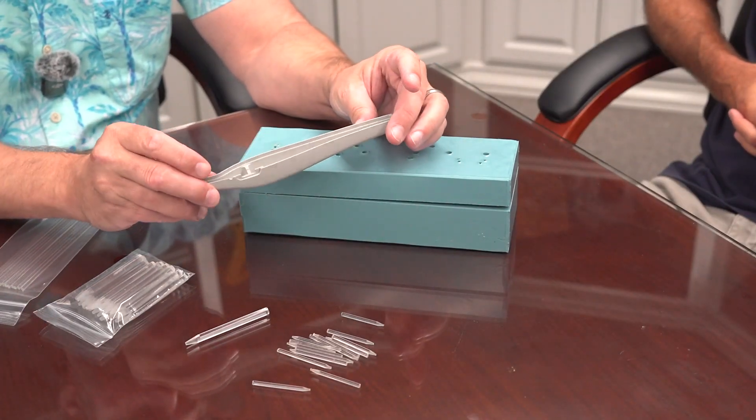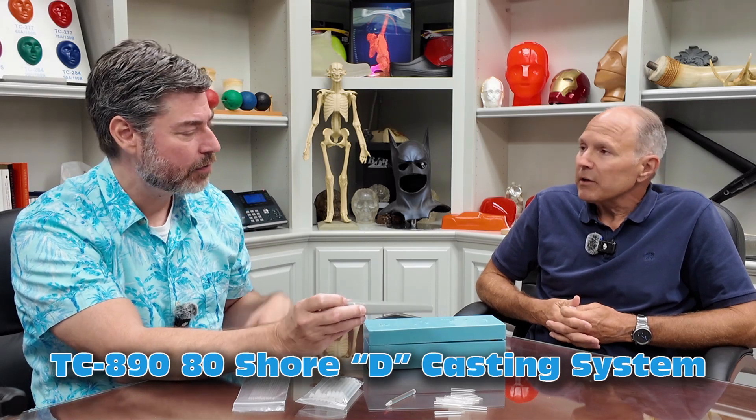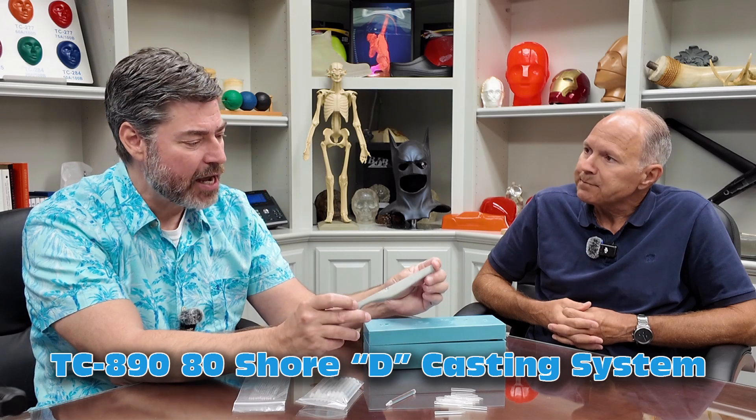On this part, is this one you typically cast under pressure? Yeah, I do. If I have a pressure chamber available, I use it, if I have enough time. This part will ultimately be injection-molded — probably ABS. What did you originally use to cast this one? TC 890, which has a work time of about six minutes and a demold time of about an hour to an hour and a half. Also important — you guys have some fire-retardant formulas. So you do have some flame-rated formulas for applications where the end part might have to be flame-rated.